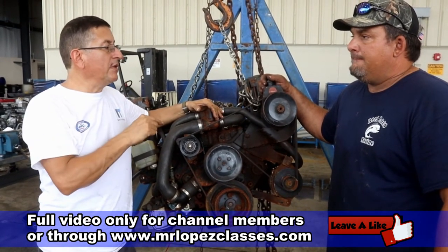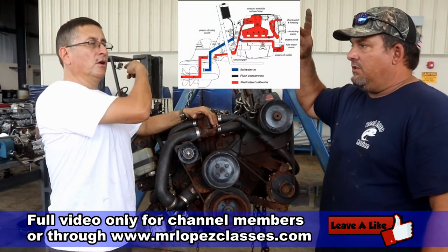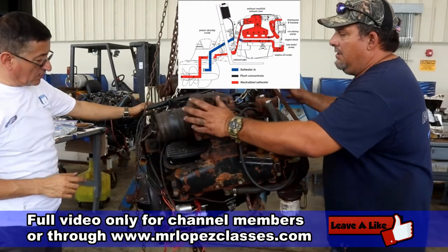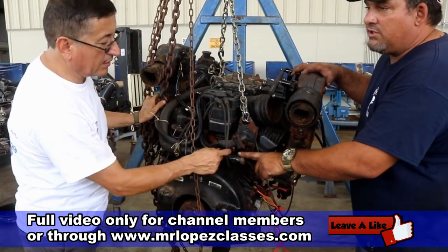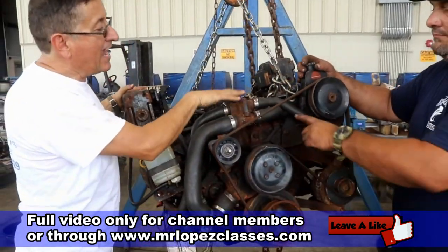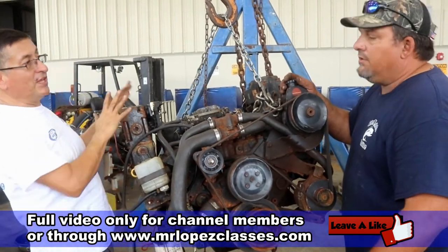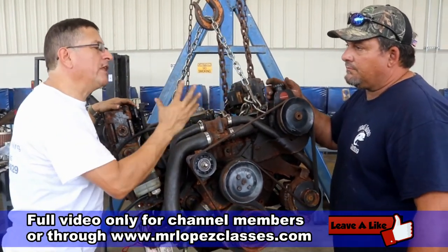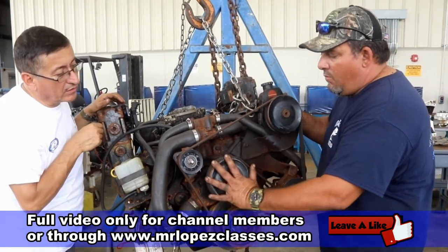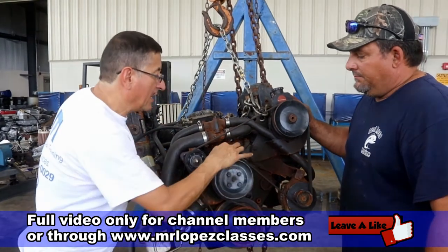In this IO stern drive system — you can see the picture above showing the raw water pump in the lower unit — the raw water enters there, then goes through the power steering cooler. The raw water then continues into the thermostat housing. If the thermostat is open, the water enters and circulates in the block; if not, it returns through the risers and exits. Not all the water enters the engine — some amount gets expelled out. You have a circulating water pump that circulates water through the engine for cooling.